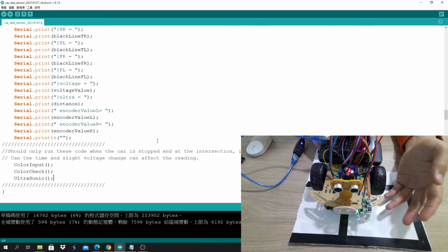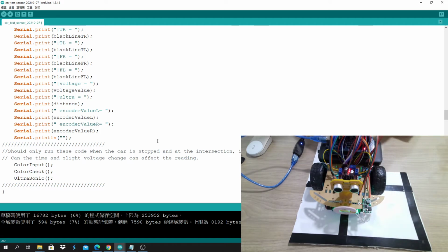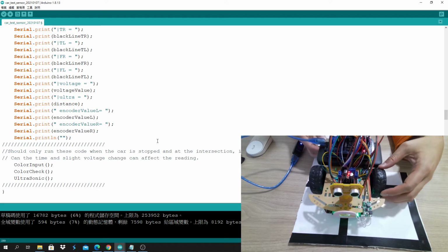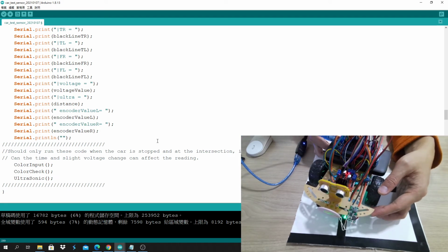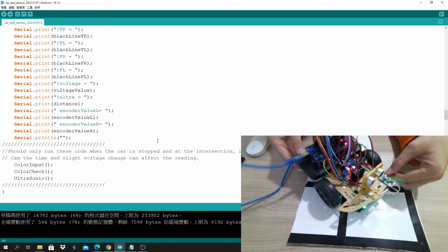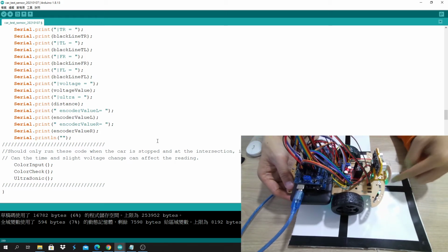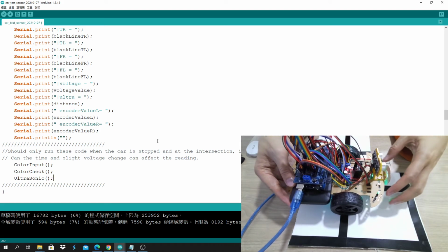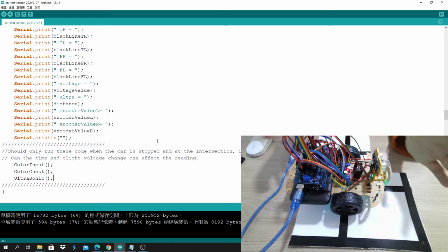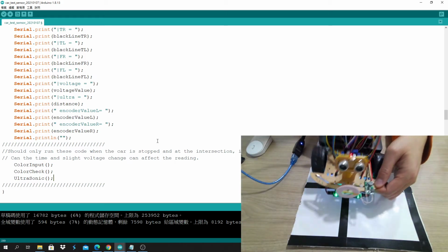If you get the go forward program working and it's done, you forget about that and go to the next part. Do not mix the programs together. Doing the functions one by one is the best way. For example, after you finish the right turn and stop, everything works fine, you're not away from the intersection or in the wrong direction, then you turn 90 degrees, and that should give you exactly 90 degrees, and then after that do something else. So you can chop the big program into separate parts.